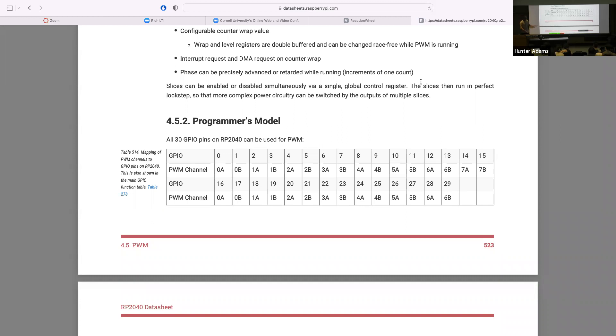You're going to use the accelerometer and gyroscope to figure out what angle the arm is presently sitting at, look at the difference between the current arm angle and the desired arm angle, and using a PID controller — the details of which we'll talk about in lecture — compute a control input. The PID controller takes the error in angle as input and gives you a duty cycle and sign as output — how fast the motor should spin and in which direction.